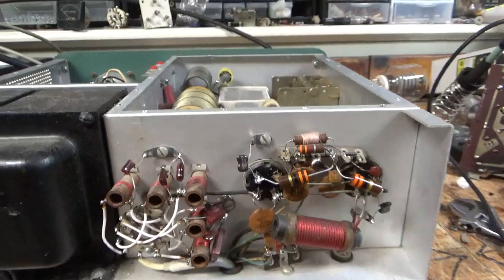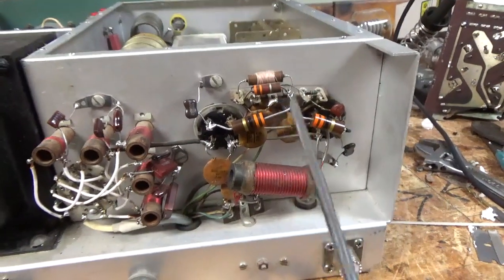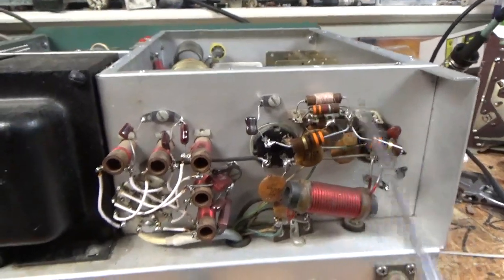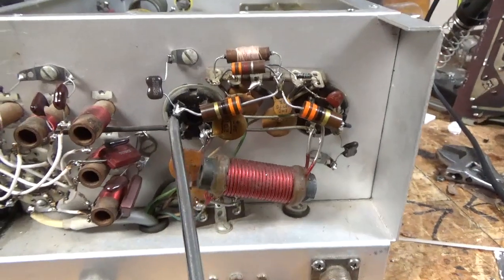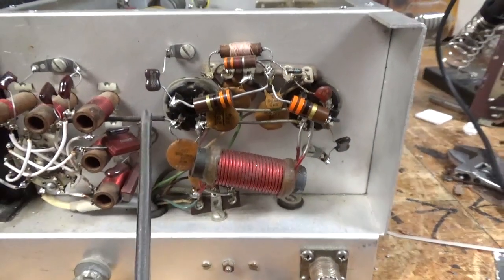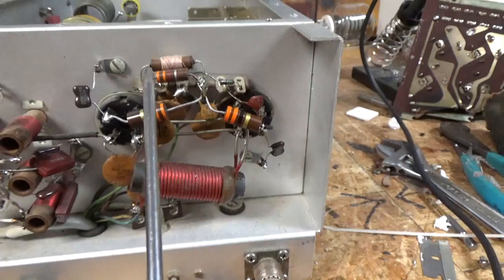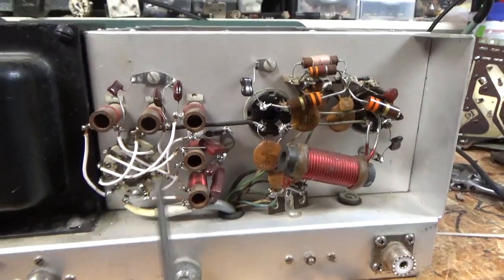Here's the back. One of the 33-ohm resistors was blown in half - someone had changed it at one point. I put two brand new Allen Bradley 2-watt carbon comp resistors in here, they read 33.5 ohms, both the same. Soldered really well, lead lengths as short as possible. I changed the 200 pF mica cap between the grid and ground. Compressed the socket clips on both sides carefully and cleaned them all with Deoxit Gold. I always check all connections to make sure nothing's touching. Cleaned the input rotary switch with Deoxit Gold.